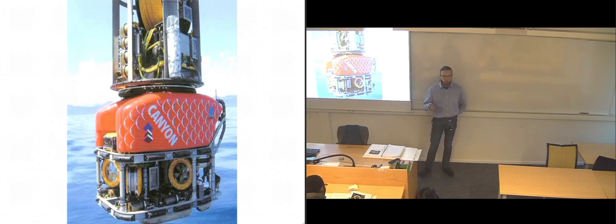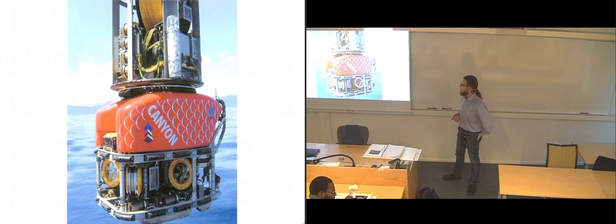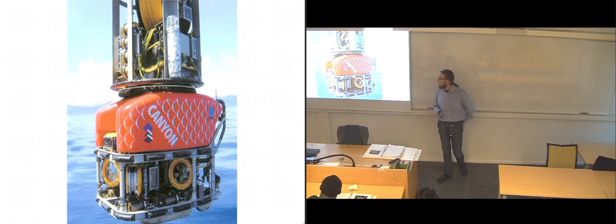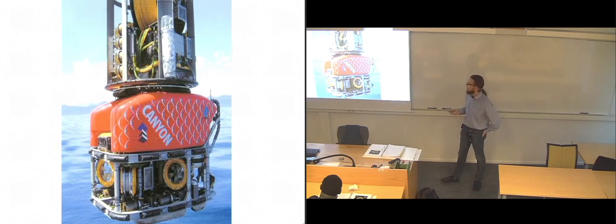Usually when you see a fully electric ROV, it's just a regular observation ROV. So it just has electric propulsion on its thrusters to move it around, and it has electricity for lights and camera, just so that it can look around. But this one actually has manipulators that it can use. I think in this image the manipulators are sort of hidden on the other side, so we can't really see them. But it can do some work, but mostly lightweight tasks then. So it's a step in the right direction of developing larger and more efficient work ROVs, fully electric.